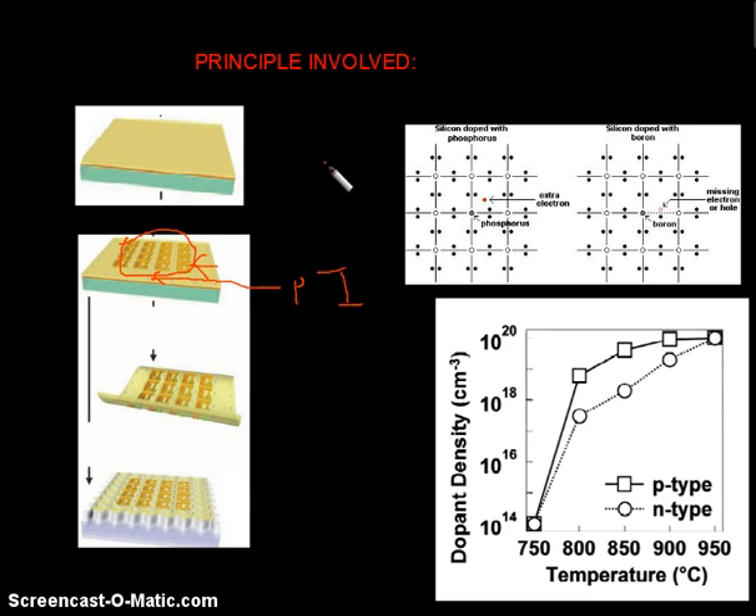These silicon nanoribbons are actually the place where all the magic happens. Let's take a look at how these silicon nanoribbons are actually made. First, an N-type silicon on insulator wafer is lightly doped with boron via a spin-on dopant at a diffusion temperature of about 550 to 600 degrees centigrade to define P-wells. Here we see boron as an impurity has taken up the position of a vacant hole.